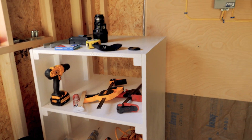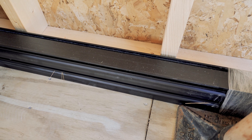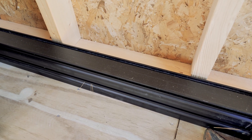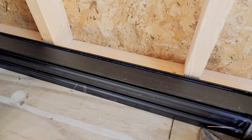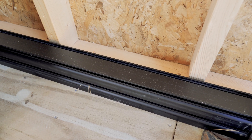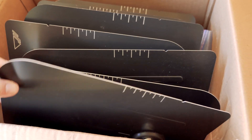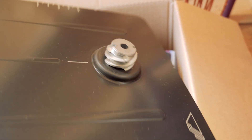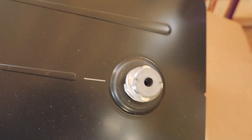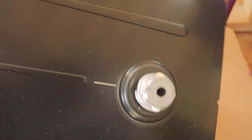Right now we want to start installing the solar panels. I have four 11-footers for rails — I'm using an Iron Ridge system. These will connect to make a 22-foot span, and I'll cut about a foot off each side and run two rails, top and bottom. I've also secured most of the other balance-of-system hardware using Iron Ridge flash foot tubes — everything's black, so it'll match up nicely with the asphalt roof and the black rails.